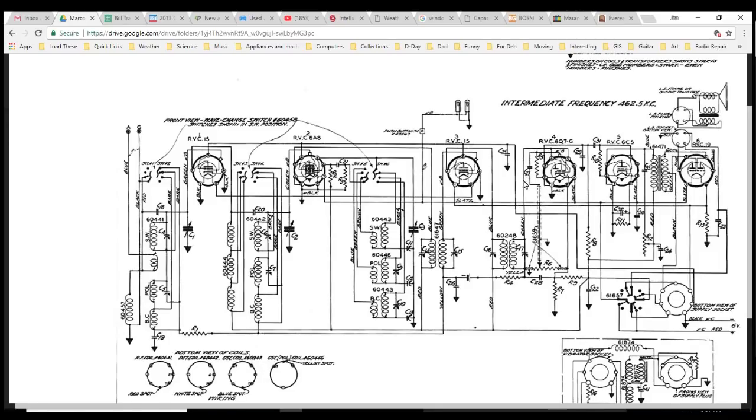on this wire here, this green wire. Okay, the DC that's building up can get all the way here. Could, well, I guess it can be added into this battery voltage. So AVC is zero, you just have this. Maybe that's what's happening. There certainly is a connection through here. We don't know how big these resistors are. This is probably a whopper, not for wattage, but for resistance.